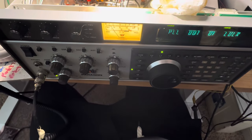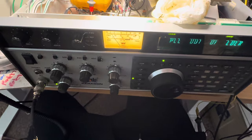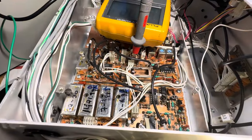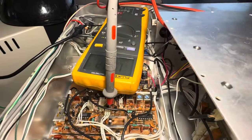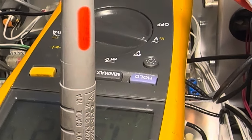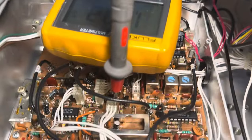Hello friends and followers. Fooling around with this Tentec Paragon, I've found another way to seek a phase-lock loop lockup. I'm having trouble with 40 meters, but I found that you can put a meter in AC mode. This is giving a series of pulses to the CPU chip on one pin, so you can measure pulses on AC on a meter. I'm on AC mode now on this meter, on this pin right here.